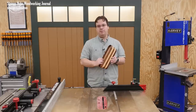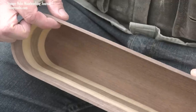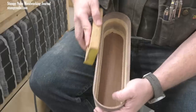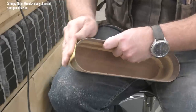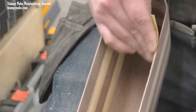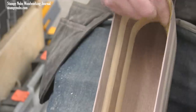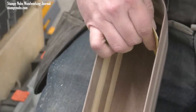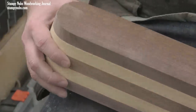Now is where the illusion happens. Note that the rim is about a quarter inch thick at this point — that makes for a good sturdy basket but it looks a little heavy. So I'm using a sanding block to thin that edge out by holding it at an angle and sanding all along the upper layer of wood. Then I blend it out with some hand sanding so it's difficult to tell that the outside of the rim is tapered at an angle that's different from the rest of the basket. I also use some fine sandpaper to even out any undulations on the inside of the rim so I have an even width of about a sixteenth of an inch all the way around. Spend a little extra time here at the rim because that is what people will notice — slight bumps down inside the basket will be hard to see, but any imperfections along the rim will stand out immediately.